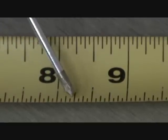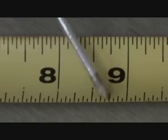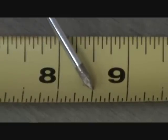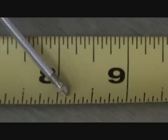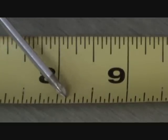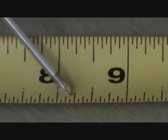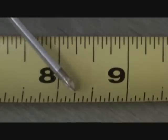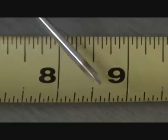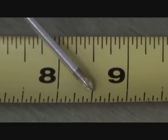But then it's split up in quarters too. So here's a quarter, and there's a quarter. This is two quarters, but that's a half. So when you're reading this, if I were to say right there, that would be eight and one-eighth of an inch. If I go to there, that's eight and three-eighths. You wouldn't go eight and two-eighths, because two-eighths is a quarter. So you would say a quarter. On quarter increments, you would go eight and a quarter, eight and three-quarters.